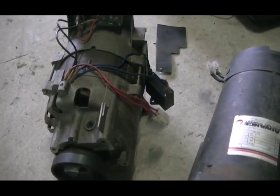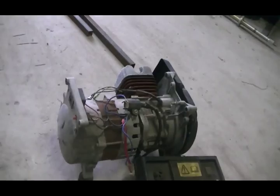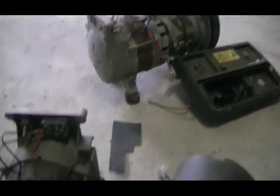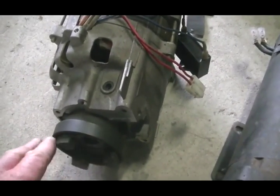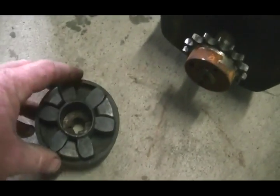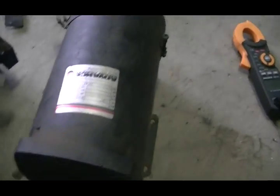I'm going to have a play around with the same sort of thing here. I have one of these old cheapo 850-watt generators — I have about five or six of them laying around. All I've done with this one is cut the motor in half to get the support cage and bearing on one end of the shaft, and I've put a drive coupling on there. I have the other end of the drive coupling here, which I'll have to machine out to fit on the shaft of our 24-volt DC motor.